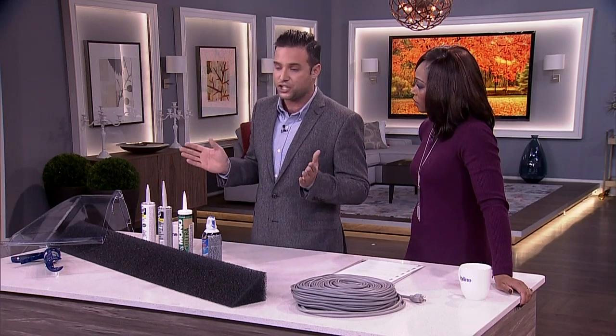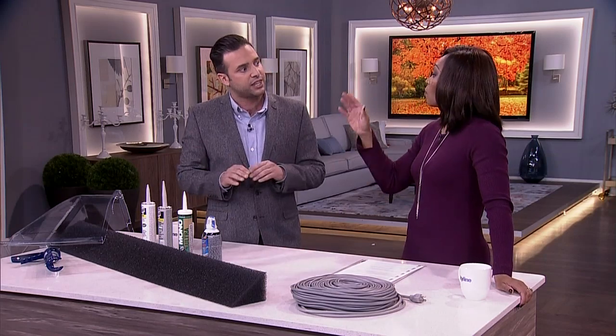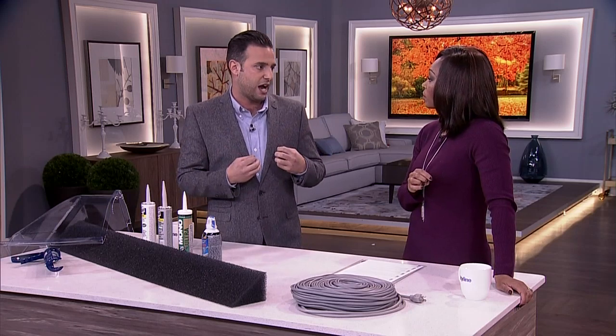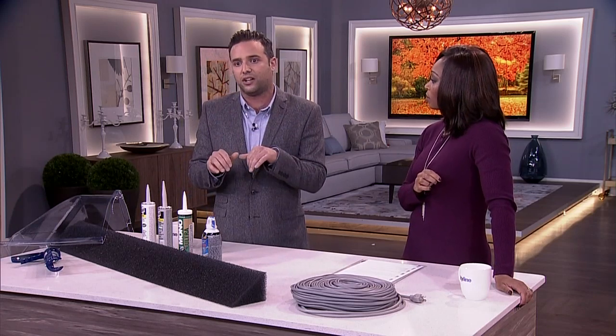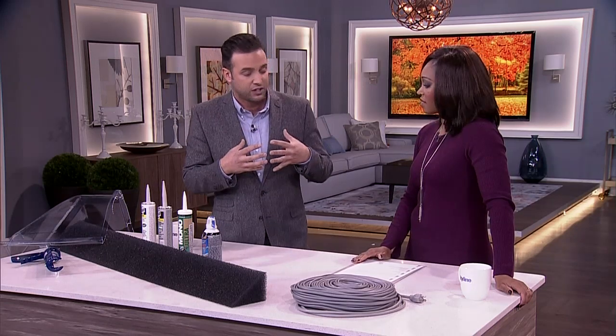And also pay attention to the brick and the masonry. You're looking at what's chipping, what's letting leaks and air in. If you have an older home, water can work its way in behind the bricks, and water freezes and expands. Water gets in on a mild day, then it freezes, and then the bricks literally will pop off the house. That's not a good sign. This is a masonry silicone.